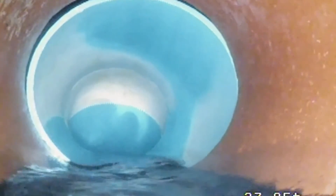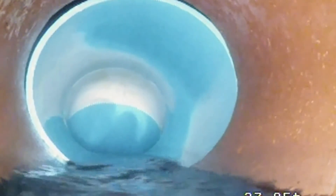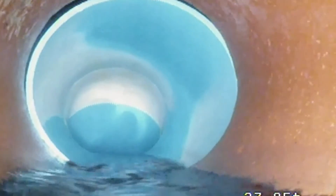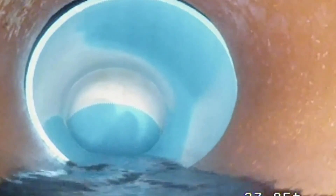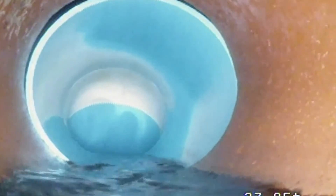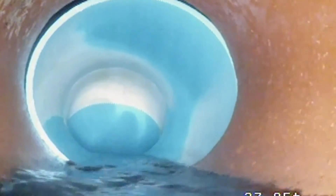Top left between the 9 to the 2 o'clock position, you can see the black Fernco. Whoever made this repair did not use a transition from SDR to schedule 40 or SDR to clay. So on the SDR, that transition should have been used when you put the Fernco over and torque it down — it doesn't squeeze the pipe. That's what happened here.